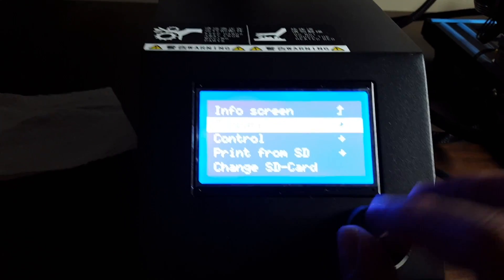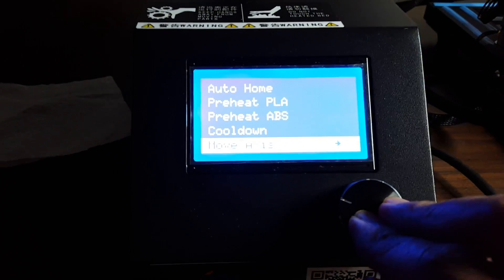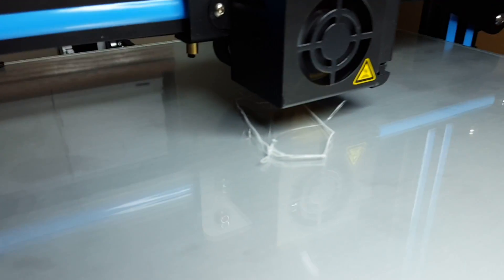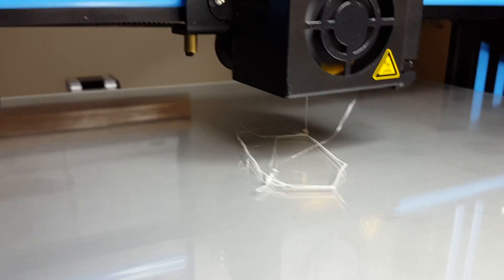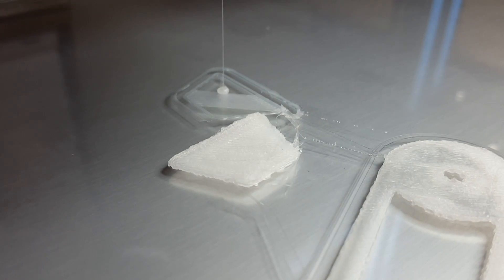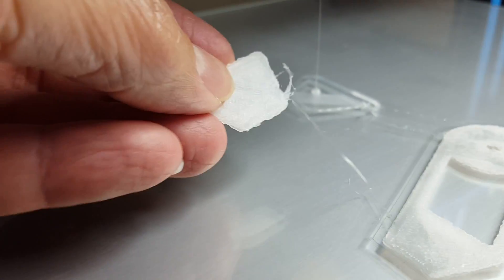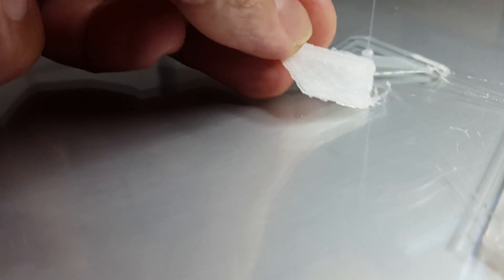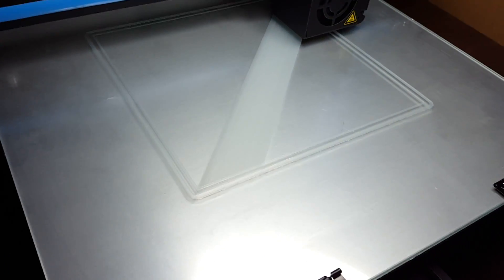You can control everything manually. Prepare, move axis. The Z axis for safety only moves sub-millimeter at a time, so turning the knob clockwise moves that up very slowly. I think I might have to put something underneath to make the bed bow up a little bit. Well apparently I have the nozzle way too close to the bed, because it started creating a protrusion over here and then it shifts and moves it. It sticks pretty well actually - after it failed and moved, it started printing the next layer and that layer actually still sticks. I think I better bring the nozzle up a little bit.